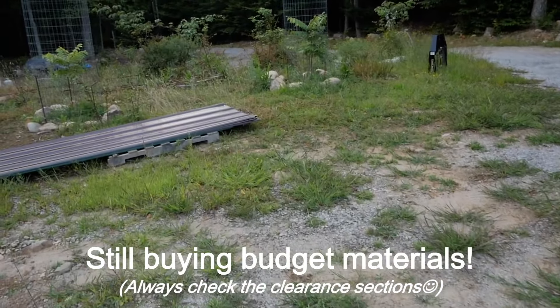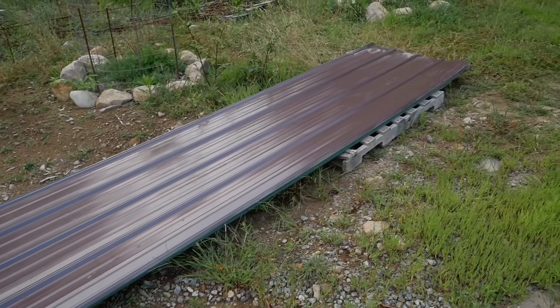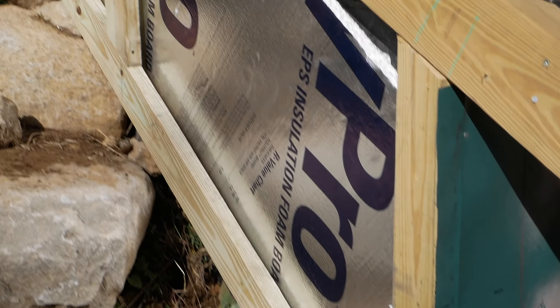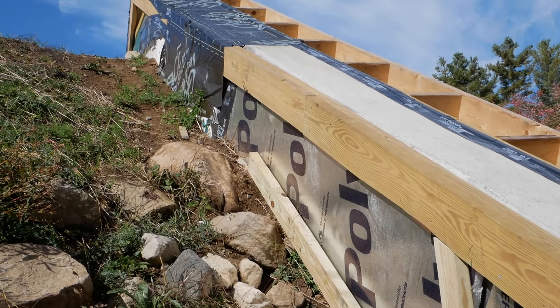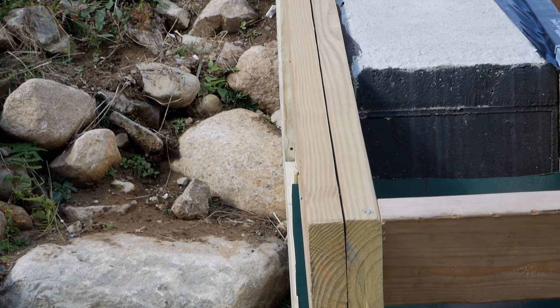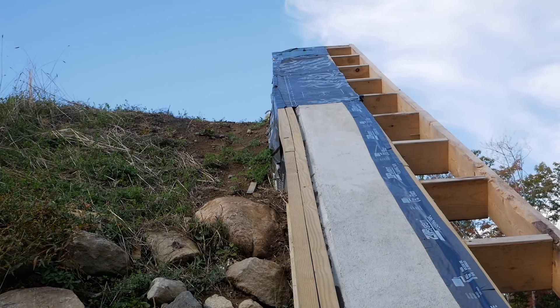We want to make it look nice and finished at the same time. We got some budget roofing material — brown and green. The green is for the roof. The brown is actually for the back of the parapet walls. We got it on a huge discount because each one is damaged in some way. We decided to use brown metal roofing, but that doesn't have any rigidity, so we decided to frame the back of the walls using pressure-treated two-by-fours on end. We framed the bottoms as low as we could, basically at the level of the rocks and dirt that we added last year. We also added vertical pieces every 36 inches on center so that when we overlap the two pieces, we have something to screw them together into. You see that bulge of concrete right there in the middle? That's where we're going to have to float around it somehow and make it all work.